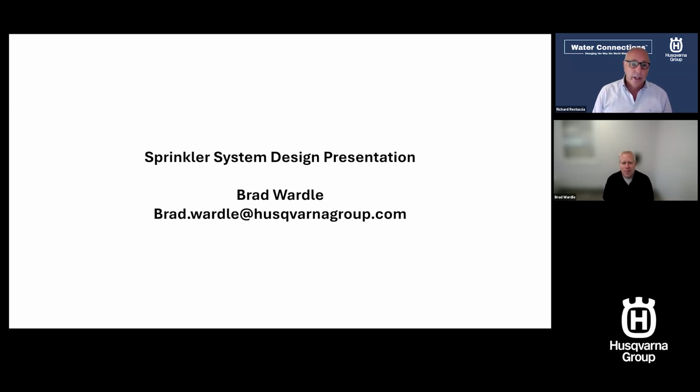Today we're going to talk about something that really doesn't get enough play, is really critical to the success of your irrigation, your watering, your water management, and often gets ignored because people think it is just too hard, and that is your sprinkler irrigation design. What I find as a result is some people just wing it. And some of the disasters I've seen as a result of that, mainly in wrong sizing of pipes, so that their system just doesn't deliver the amount of water they need, which continues to provide trouble year in and year out, and makes a very expensive repair because you have to go back in and retrench everything.